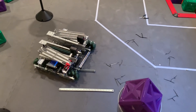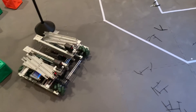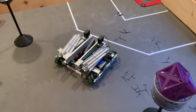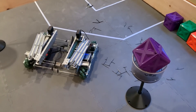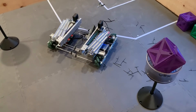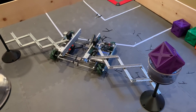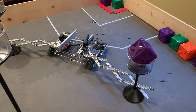We replaced the linear slides with two of these, and to help prevent sagging, we added a set of half slides to each end of the robot. We were now ready to test. We put the bot on the field and tried to expand — it worked. The slides didn't reach their whole range simply due to the leverage put upon them by the sagging, and the twisting of the edge slides probably didn't help. It was not quite as wide as using the Vex slides, but it was still plenty wide, and we didn't have to worry about turning into a surprise multibot.